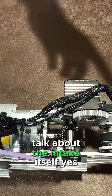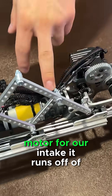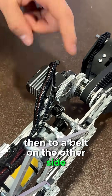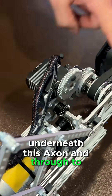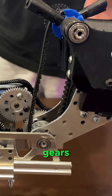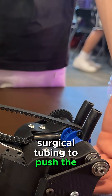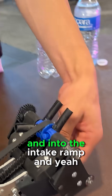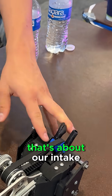Sebastian's just going to talk about the intake itself. So this is the motor for intake. It runs off of these two 90-degree gears then to a belt on the other side underneath this axon and through to this belt which powers the top intake rollers. The top intake is then connected through a series of gears over here to the bottom. The top roller has surgical tubing to push the piece in and then the bottom roller is just silicone to kick it up off the floor and into the intake ramp. That's about our intake.